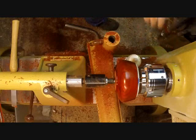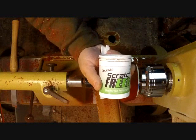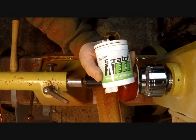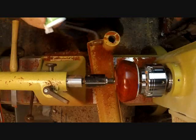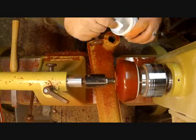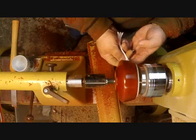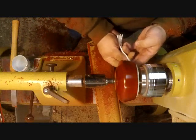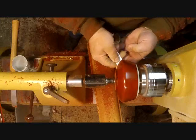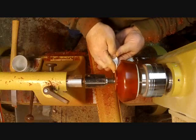Next is a Tripoli compound. The particular brand I like to use is Dr. Kirk Scratch Free. It's very, very green friendly — no harsh chemicals, nothing toxic. The purpose of this is to smooth down the sanding sealer and provide a really nice buff. You really only need a very small amount in order to do this, and it works very well.